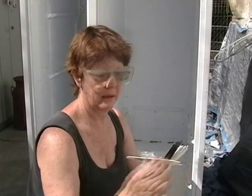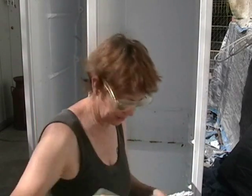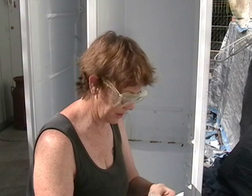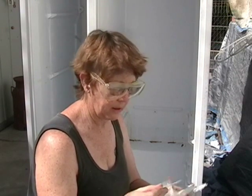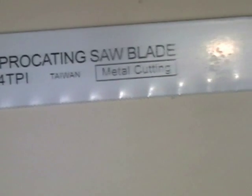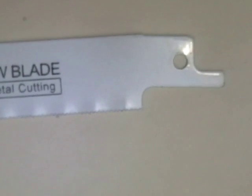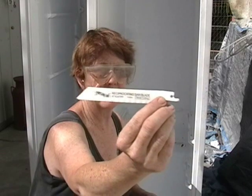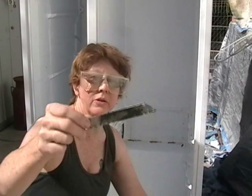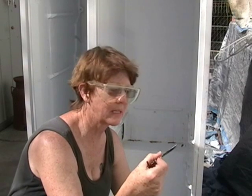The wood cutting blade has larger teeth. This one here — oh, that's been used. Let's find a better one. This one here is for metal cutting, and it has a very fine blade. I'm thinking I want to go with the metal cutting blade. This other one was used for any other kind of junk — it's completely coated in plastic. I must have been sawing on a tank or something.